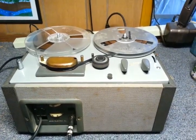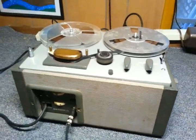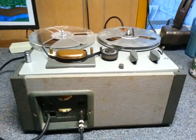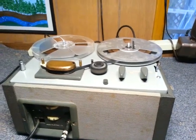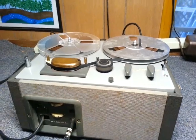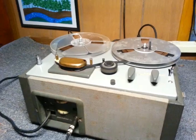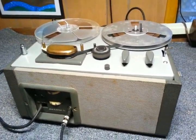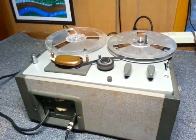Then I thought, you know, I tried twice putting in capacitors of different values, instead of the right value. I'm just going to flip the machine over and do a test recording. So I did a test recording, pessimistically saying that this is not going to erase and it's going to sound extremely distorted. And lo and behold, the machine came in with good sound quality and recording properly, not distorted like it used to be in the video in 2008. The bias oscillator was working just fine.